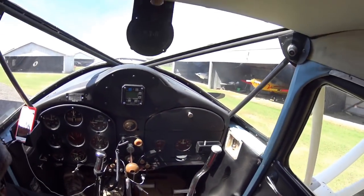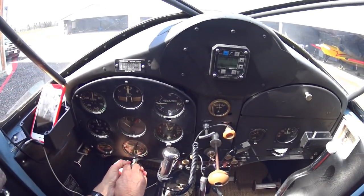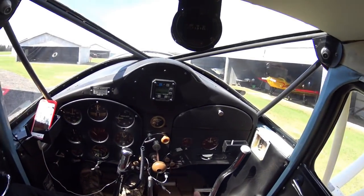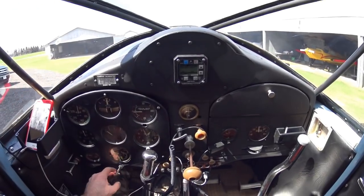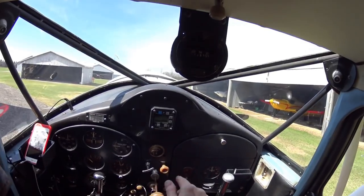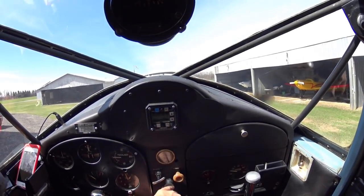The master goes on. Throttle just a tiny crack, hardly anything. Fuel has definitely been on. Now this is the spark retard — this airplane did not have an impulse mag for retarded spark. But we definitely don't want kickback because that can shear off a starter tooth and drop it into the general oil system, and then it's game over. So we retard the spark manually with this, as if it's a Model T or something. Then I engage the starter, give it two blades, and then turn the magnetos on. Clear!